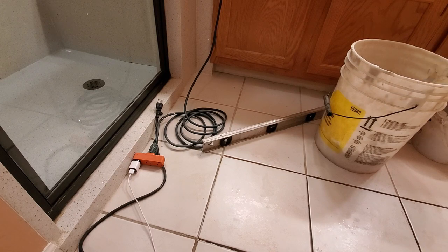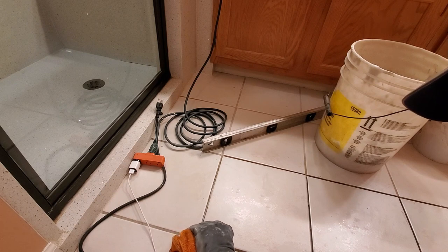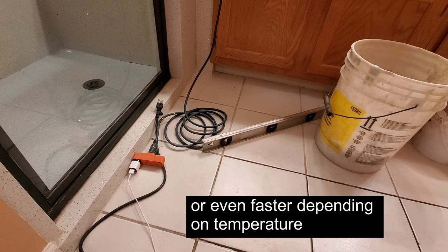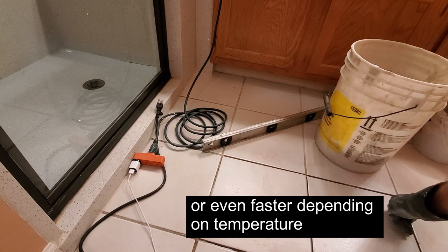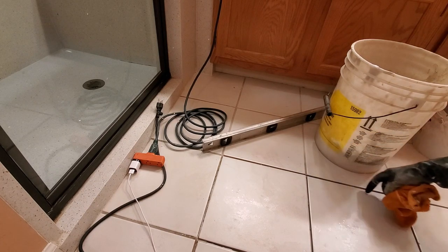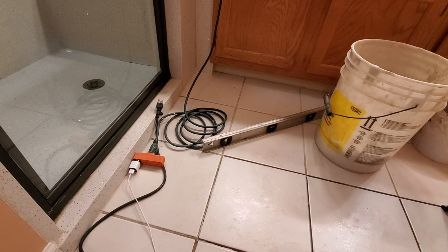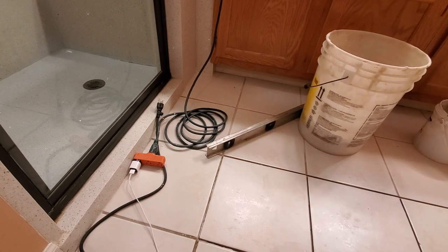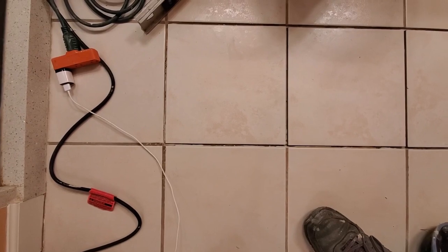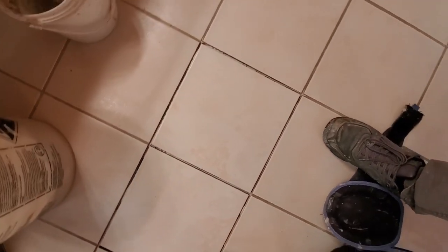Alright, I'm going to call that good. Just clean out the grout lines. Now this rapid set will cure in about 4 hours. You can grout as soon as 4 hours. I'm actually going to be coming back tomorrow to finish the rest of this job, so I'm just going to let this cure overnight. I just want to take an extra minute. So here we go. Pretty flush with the floor, at least as best as I can do.